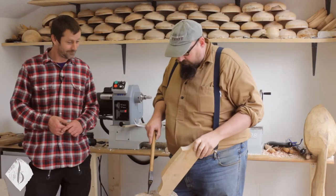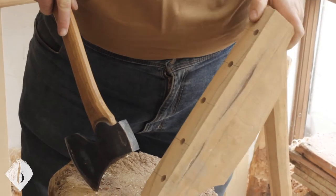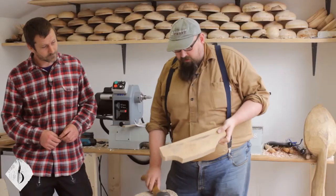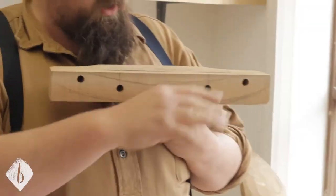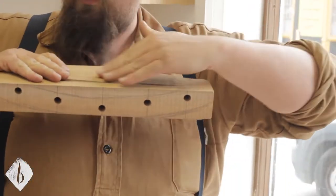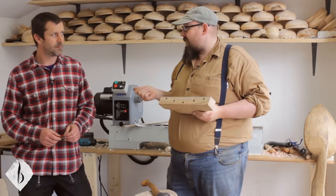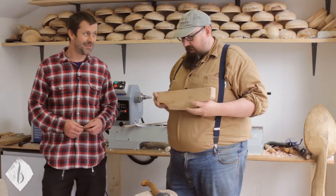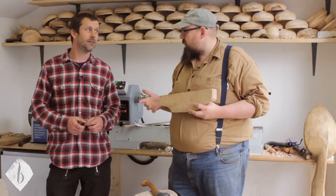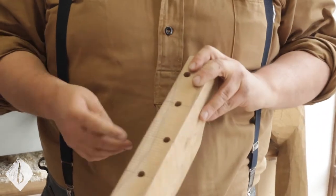In the book we've got some directions on shaping the crest with an axe. The main thing is that if it's a straight bit of wood, to get this shape into it you have to come from both directions. The sensible thing is to steam bend it — that's what most chair makers would do — but that's a lot of effort and you need quite fancy wood. We've just taken this from the plank and we're going to shape it with an axe.